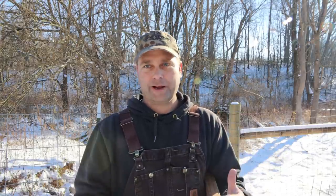In the last video I posted on the pasture fencing when I was hanging the gate, several people asked me what I did with the culvert that went underneath the fence line — and what I did to secure it to keep predators from crawling through and getting inside the pasture. Well, honestly I totally forgot about it, it completely slipped my mind. So thank you guys for bringing that up. What I'm trying to do right now is cover that culvert. I took a piece of stock panel — a sheep and goat stock panel with a four-inch square opening, the same as our fencing — and I'm going to put that right on the inlet side of the culvert inside our pasture.